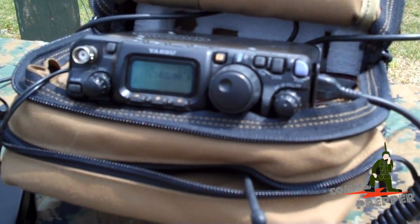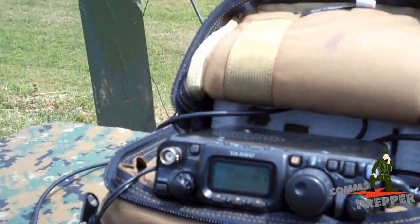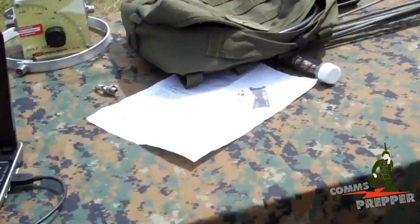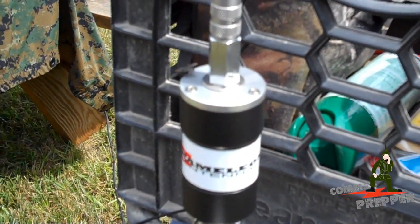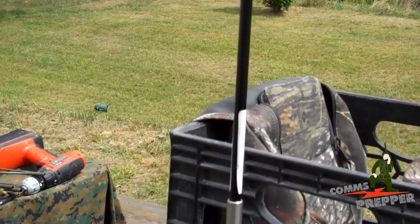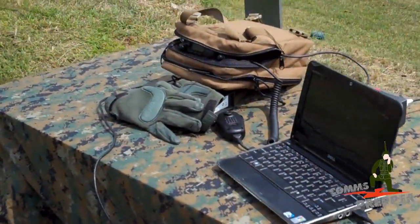We've demonstrated the potential of having a quick, tactical, and portable antenna for emergency communications. I'm going to take the whip antenna and hybrid micro down from the post and put it on the back of the ATV. We have another connection — station W3JY — connected to the Chameleon whip antenna with the hybrid micro mounted on the rear of the ATV, using the wire antenna as the counterpoise on the bottom of the mount. This is a really solid antenna. I wouldn't drive or go mobile with it for fear of breaking it, but if you had to go somewhere and park, you could easily set this antenna up in about 10 minutes and be on the air.